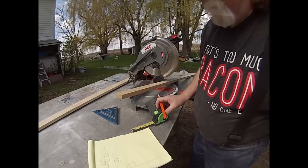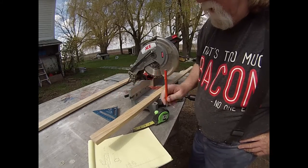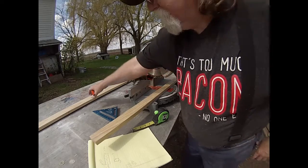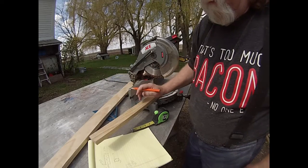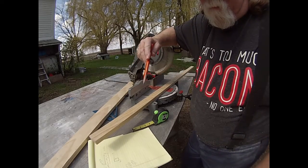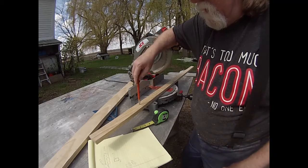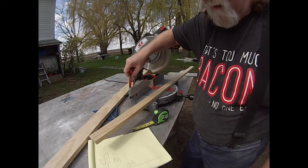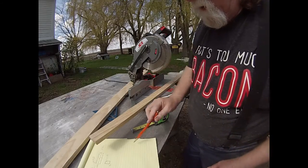So let me grab the wood. Two sizes of wood. This piece will go along from front to back, so I need to cut those 21 inches. And this wider stock, I'm going across the front. I want the wider piece, and the first cabinet is 17 and 3/4. I got to take away the 3/4 inch on either end for the plywood and the thickness of these, so each of those is going to be 12 and 3/4 inches. So let me get to cutting these, and we'll at least get one of these together today.